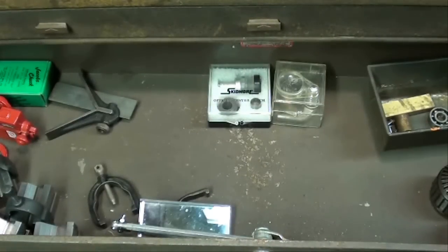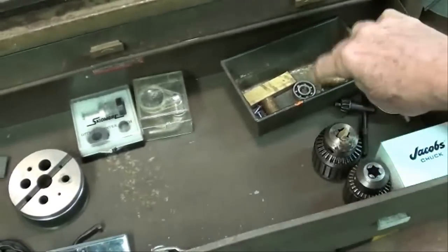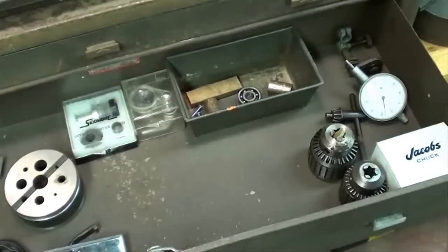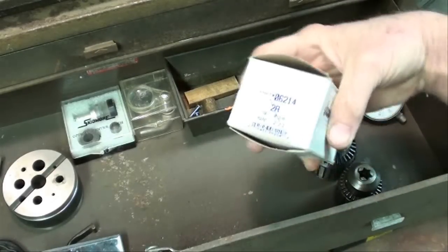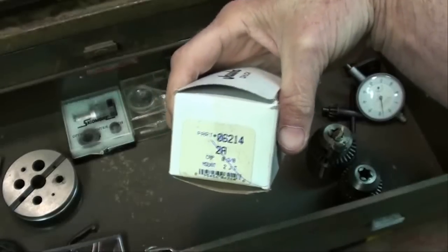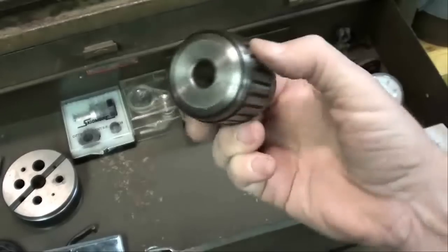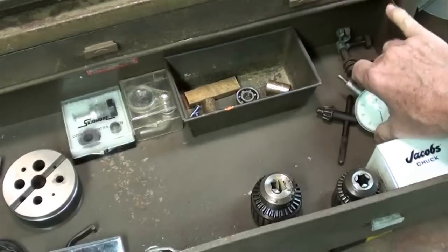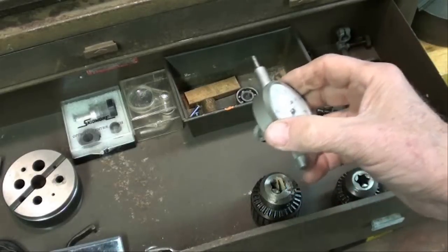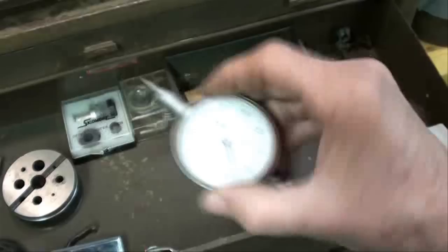This one's quite heavy. Here we have yet another unfinished project — I forgot what that was for; I should throw it out. We've got several brand-new chucks here. There's a Jacobs chuck, but it's only a three-eighths and it has a number two Jacobs taper. There's a nice ball-bearing one, but it's only a three-eighths also — that one's threaded. This dial indicator fits on that beautiful little Cameron drill press to check the depth, but it was in the way so I took it off.